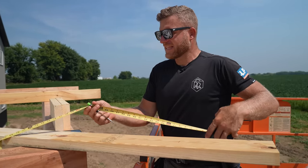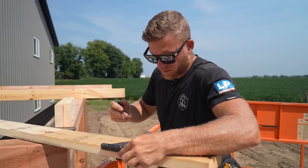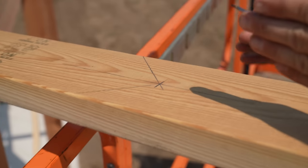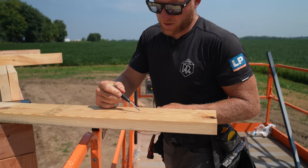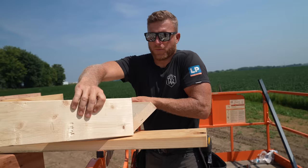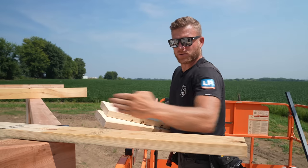This is just mathematical theory. If we do this, and if it's perfect in both directions and everything is perfect, I can run my fascia here when I cut this guy. Something like this — this will be my two-by-six fascia. Boom boom. Then I've got to cut a rafter — that'll be for our 4/12 hip that goes here. And that will die right into this. This is where I say field applied.